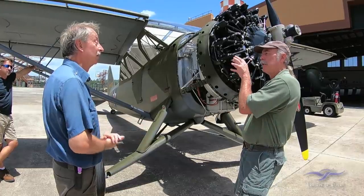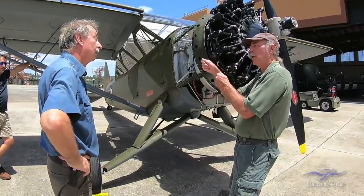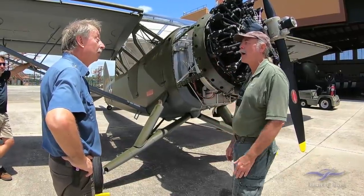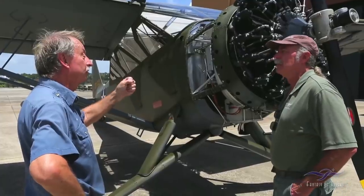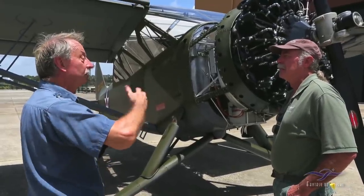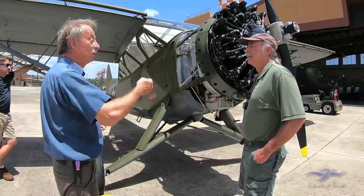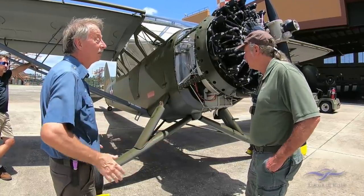Right, but we know everything is going properly from the mags to the plug when you put juice through it, but if it's not being hit at the engine at the right time, that's the problem. Exactly. But it checks all right with the timing disc, and it checks all right ignition timing wise, points open at 32 and 34. I think it's 27 and 32, I can't remember. But with a disc and turned by hand, it's absolutely perfect. But maybe under load it's not. I don't know.